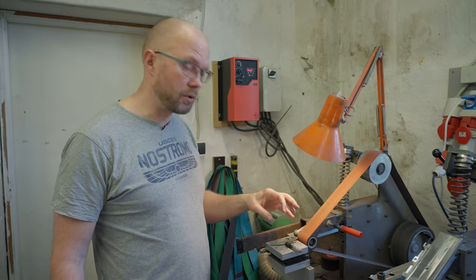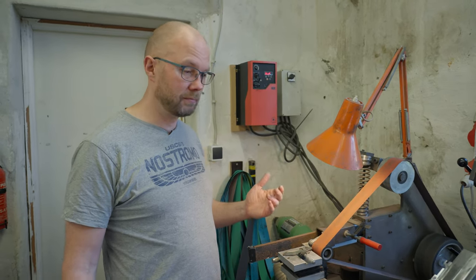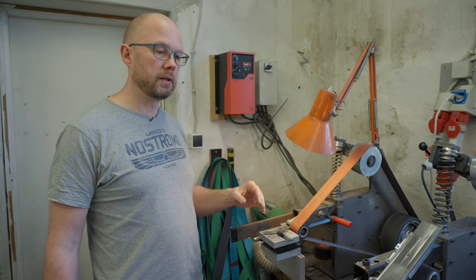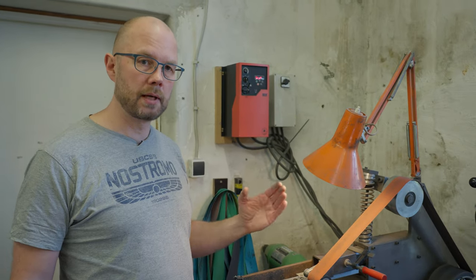I ordered these Mitutoyo micrometers from Japan, then took everything apart and tried to figure out exactly what I needed to get this to work. It took the better part of a week just to make this setup. But having invested that time in the process, it's so nice to have 110% control. Using a hardened lock insert requires, in my experience, a way higher tolerance than not using it, and this setup will give me that. Now I just grind roughly to where I need to be and then ease into it afterwards.